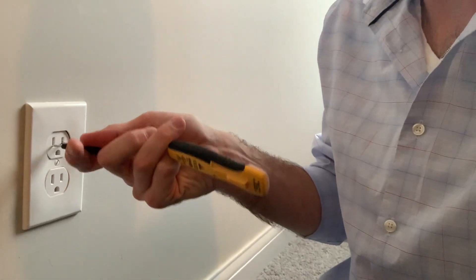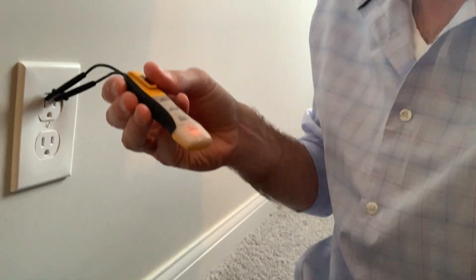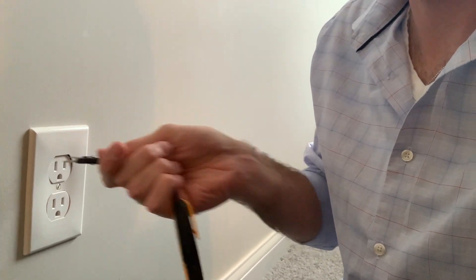So like I was telling you downstairs, what you want to do first is turn the power off — you want to make sure there's no power to it so you don't risk electrocuting yourself. I use a voltage tester. It's a very basic voltage tester. It's going to tell me if there's power to the outlet and how much power. You stick it in and it tells you if anything's coming through and whether or not it's safe to work on. Now I turned off the fuse breaker to this particular space but then I turned it back on because it gets pretty dark in here. When I plug this in it will show power, but you want to make sure and turn it off before you go after the outlet. You can see that it lights up — that shows you this outlet has power. Before we do anything to the outlet, turn the power off.